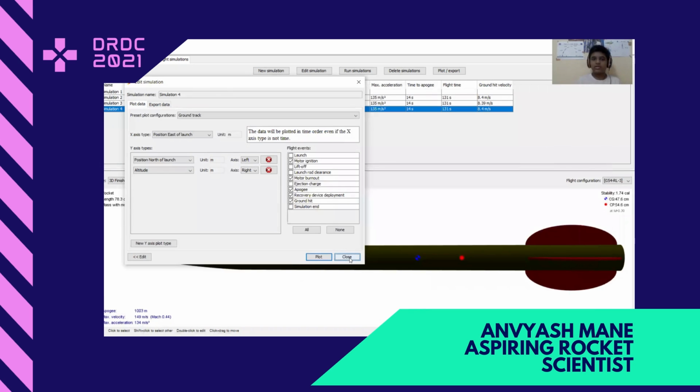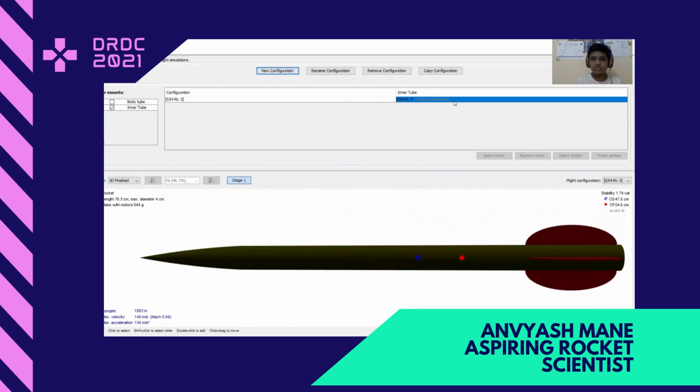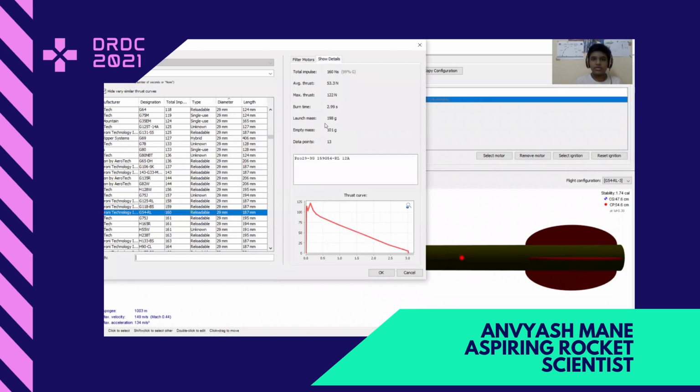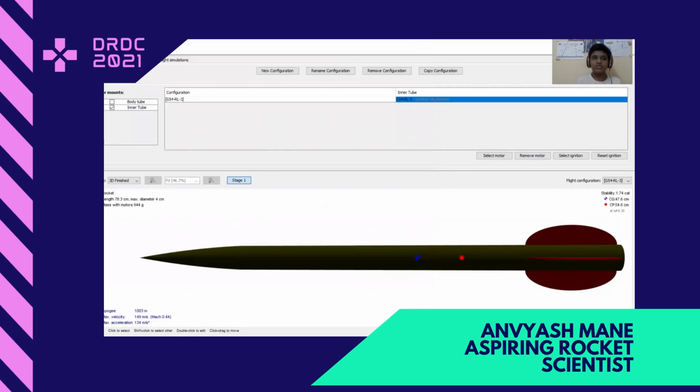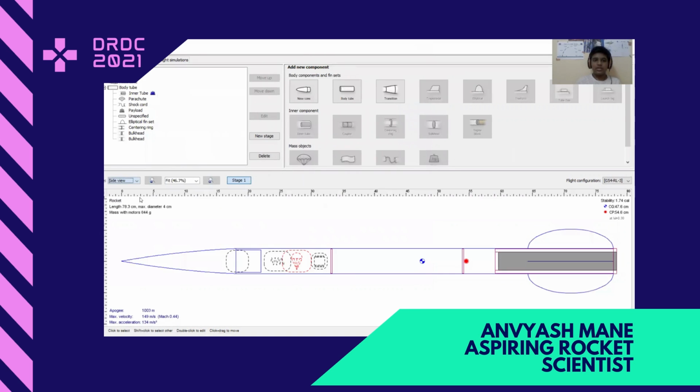So coming to the motors. The motor is a Cesaroni G class motor, with 160 total impulse, and its propellant mass is 97 grams. You can see the thrust curve here. The ejection charge delay is 3, but we are not using the ejection charge. We are using something called black powder ejection. Actually, it's embedded in the flight computers.